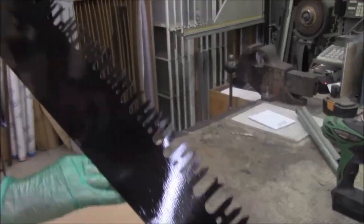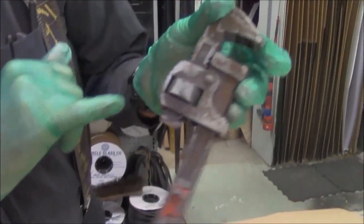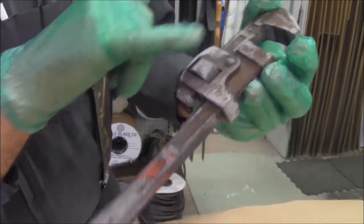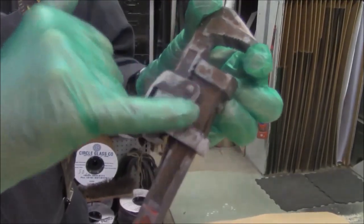So I really don't have to paint this pipe wrench — I could just leave this on and let it go. We may take, after this is dry, a little bit of oil and a rag, maybe a little paint thinner in it, and soak this down with a very light coating of oil. And we're going to go back and show you how that saw came out. We can take a piece of rusty metal that no one would have ever touched, and now it looks pretty darn nice. We've given it two quick coats of a gloss oil-based spray paint and we've saved it. In five to ten minutes, you can see where the excess phosphoric acid is leaving a white residue. You can see most of the rust has been cleaned or eaten off. You can see where the rust is thick — it's still working; the rust was real heavy in those areas.